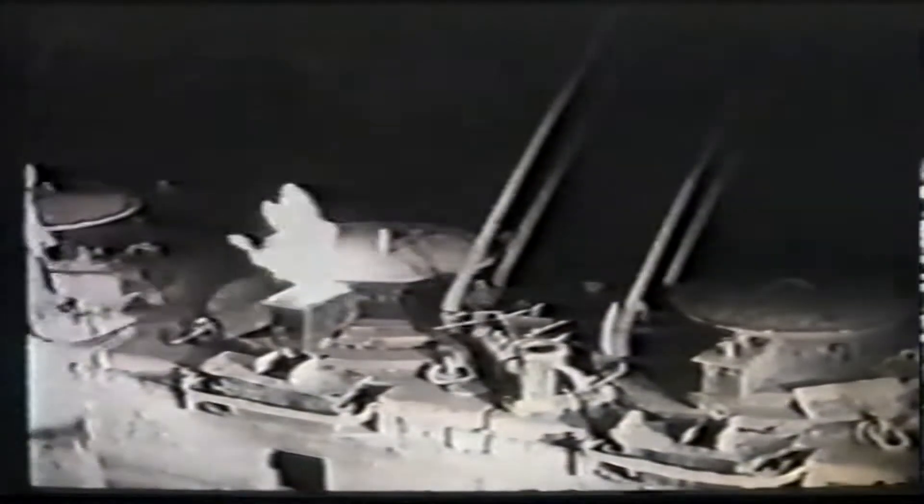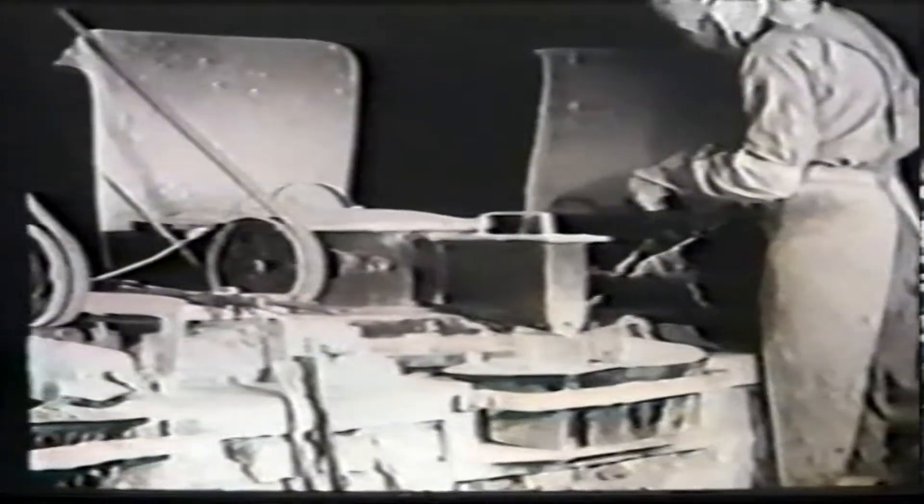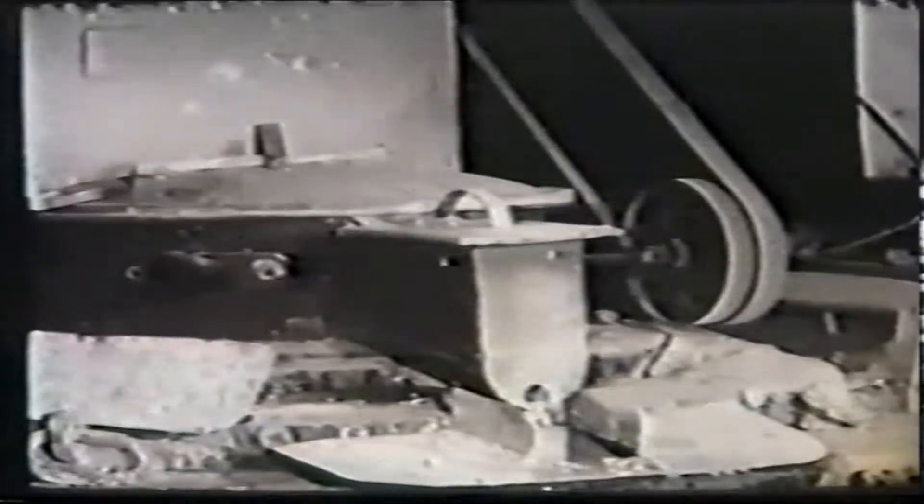Whilst working, the pots require regular attention, and in particular, to maintain the level of the electrolyte, they are fed with molten caustic soda every half hour. The average working cycle of a pot is about six weeks, by the end of which period impurities have accumulated, and the efficiency of the pot is seriously impaired.